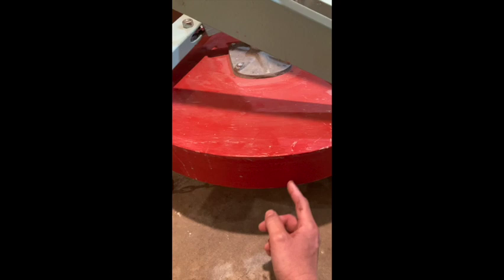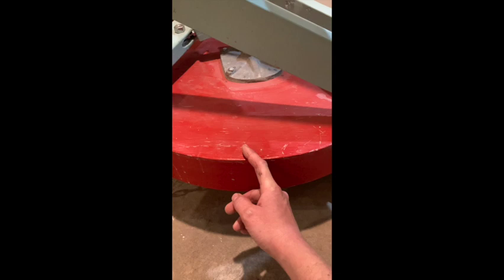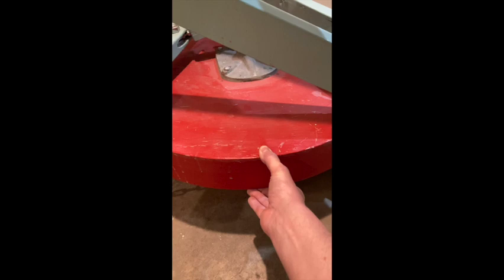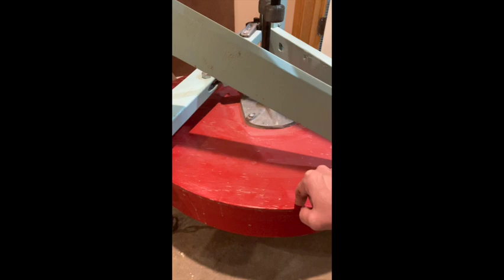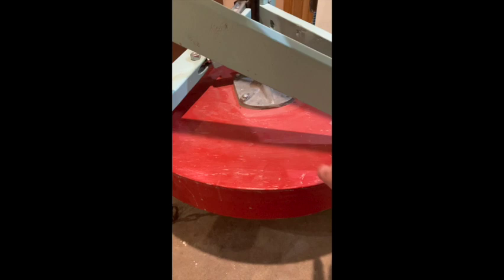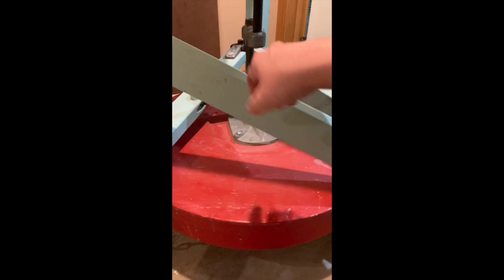It's a good weight — it works really well. You don't want it too heavy or too light, so 40 to 50 pounds is about right. I don't think these are whole pieces inside — I think the top one and the bottom one are whole. You could make this just under two feet per piece with full plywood; it's way easier and you can get eight circles out of a sheet. Because they make plywood four-foot by eight-foot in the US, this is an odd size and you have to be creative cutting your circles. The internal pieces are like quarter circles and half circles spaced around, so there are gaps inside that you don't see because the top and bottom pieces sandwich everything together. I just glued and probably screwed them too.